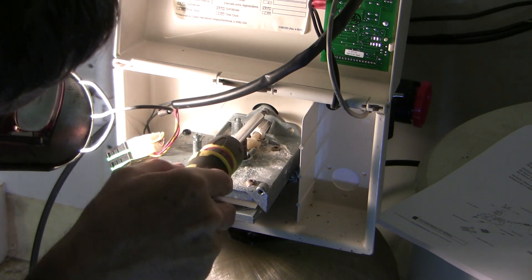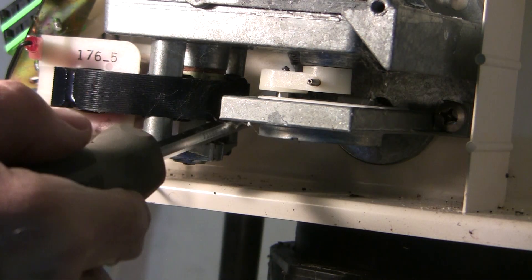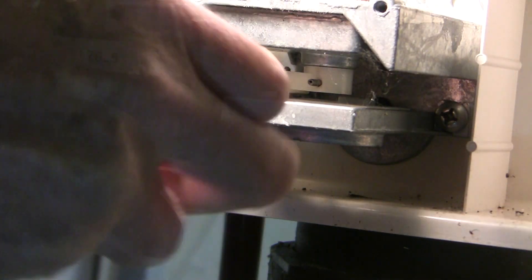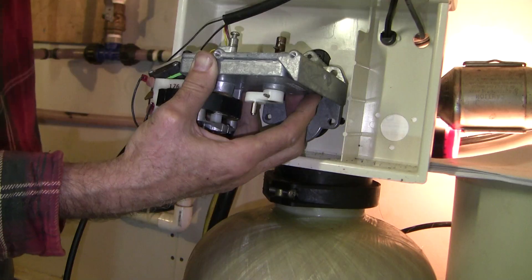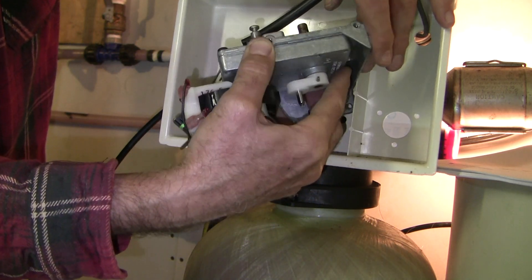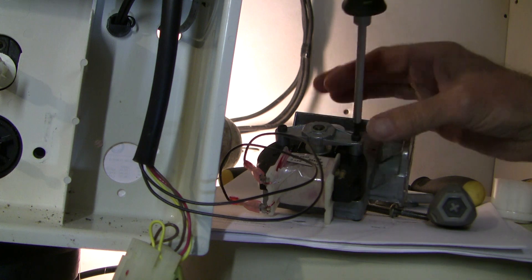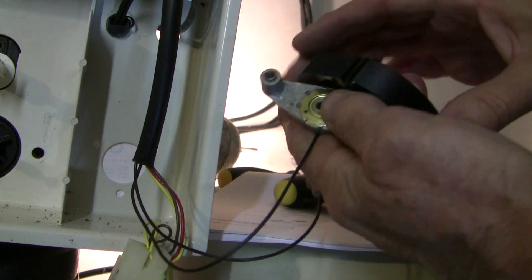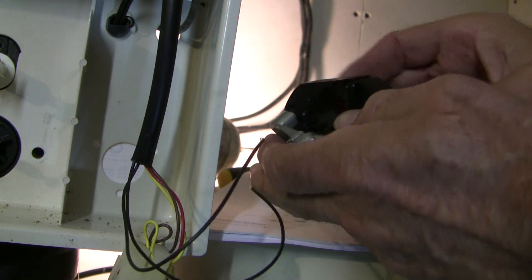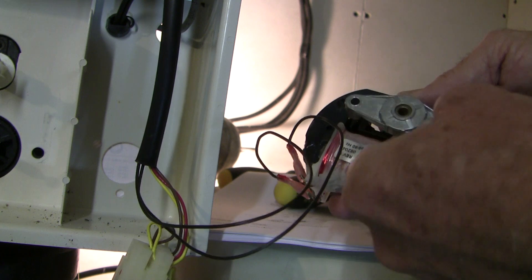The dealer's manual says the next step is to remove this screw right here, then these two big screws — one here and one there. The motor support bolts are T20, and there's the shaded pole right there. For more details about how this motor works, I did a video on an oven shaded pole motor on my channel showing how it works — it's a fascinating mechanism.